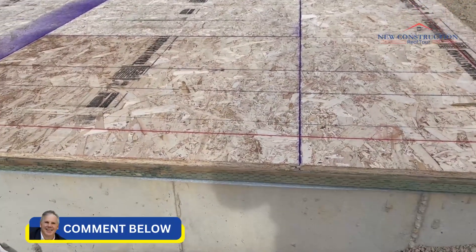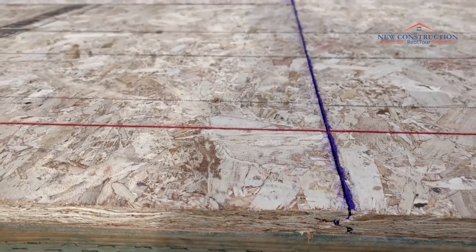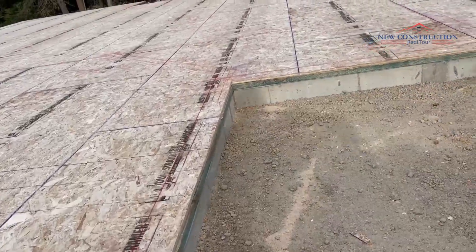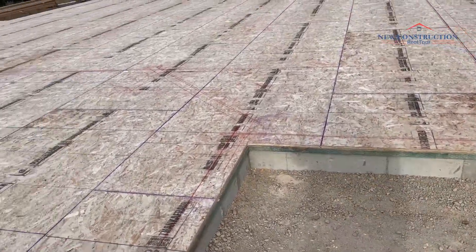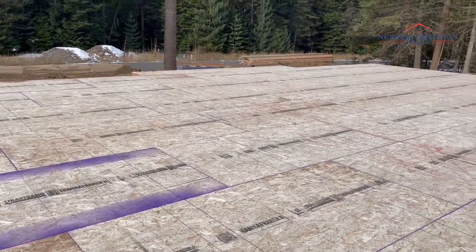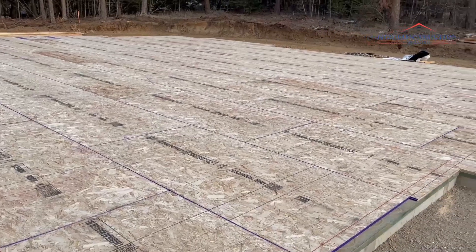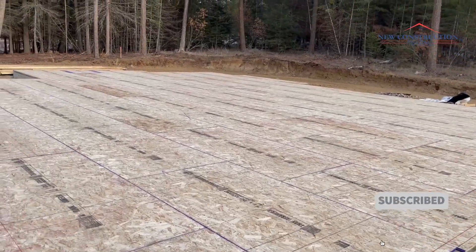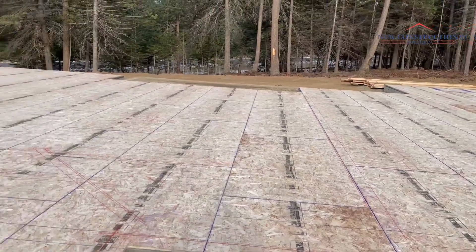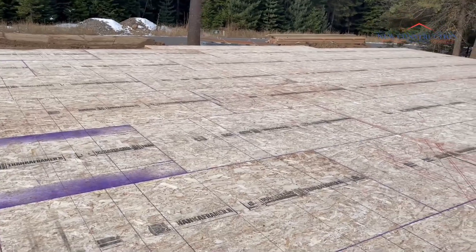Here's the plate that I was talking about — there's the foam, there's the green board. And then here it looks like five-eighths — it's a wafer board type scenario. A lot of people are always concerned when this is exposed to the elements. They put special glues in here that repel water so it doesn't absorb and become filled with mildew or any kind of mold. You'll even see snow laying on this — it can hold up to being exposed to the weather for some time.